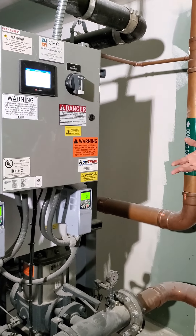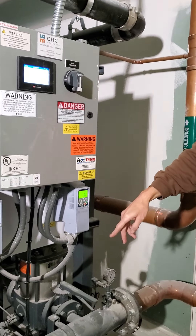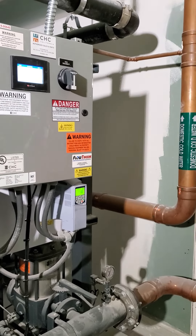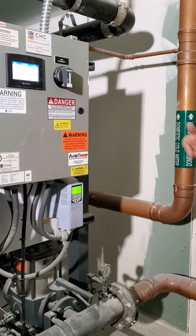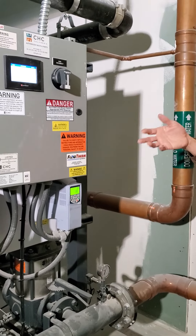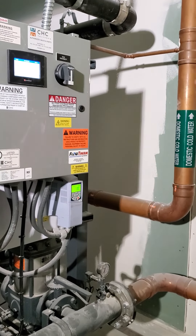As I mentioned, if the no-flow shutdown ever failed for whatever reason, that's where the temperature sensor comes into play as a safety to shut the pump off. If it knows the pump is running but the water's not going anywhere, that's where you can get that alarm — shut this side off.